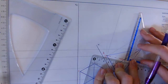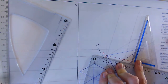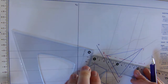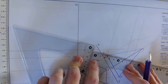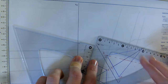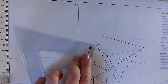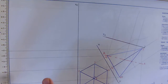We're just focusing on the true shape of the cutting plane, not the solid. Before you move your ruler, put your secondary set square back, make sure it's parallel again, then move it up and draw another XY line. I'm going to call this X3Y3. Now I'm ready to draw the right view, the true cutting plane, and the top view at the same time.